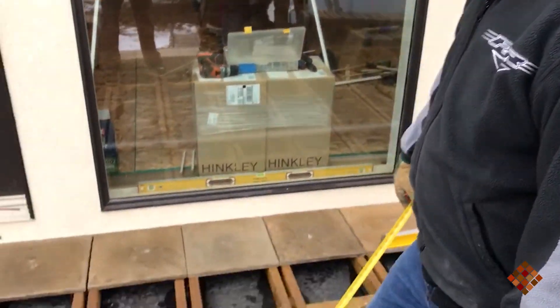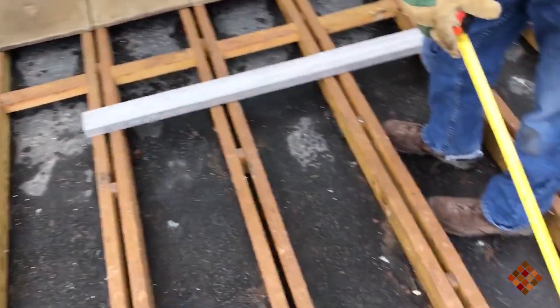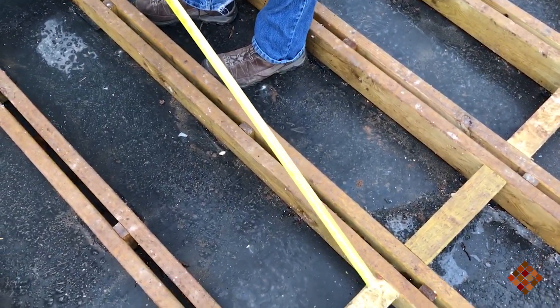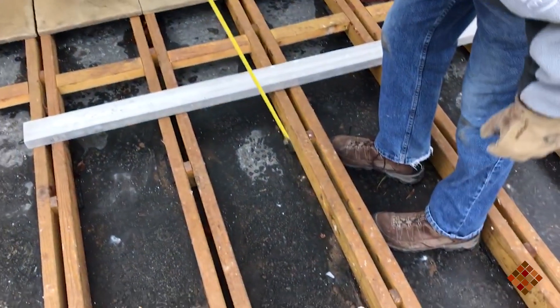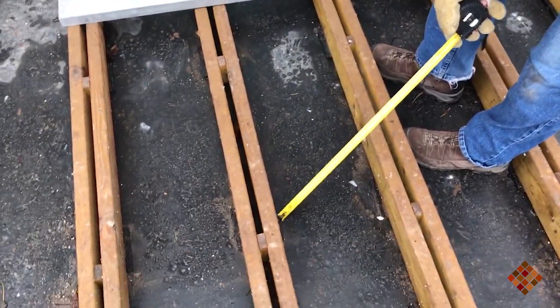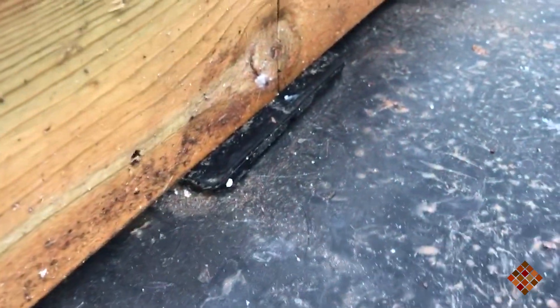To show you what kind of roof deck we're setting this on: this is a rubber membrane and it all drains down to the drain over here. The carpenter put sister joists together — it's a full 2x6 here but over there it's cut like a triangle and thinner so the deck remains level. Underneath there are thick rubber pads that elevate the joists off the rubber roof so they don't damage the roof and allow water to flow through.